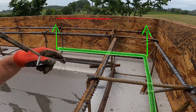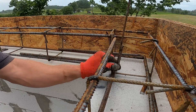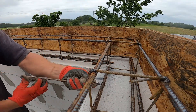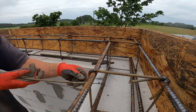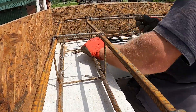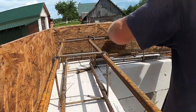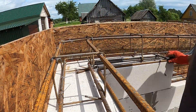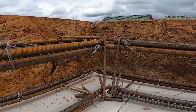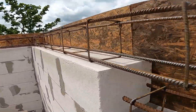It takes time — it's a bit of a grind. But if you skip this part, your reinforcement's floating once the concrete hits. This step transforms a bunch of individual cages into one unified reinforced frame, ready to handle pressure, weight, and vibration long term. We're still rocking the homemade rebar hook — just a bent steel rod, but it does the job; saves your fingers and keeps things moving fast. This isn't the glamorous part of the build, but it's the backbone of your whole ring beam. Get this wrong and nothing else matters. Get it right, and it'll hold for decades. That's the full reinforcement locked in — all the joints tied up tight. No one's going to see this after the pour, but it still has to be right.